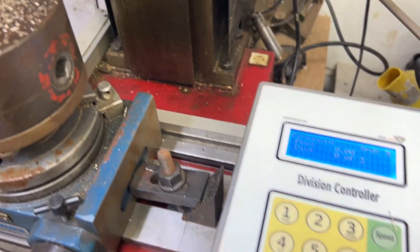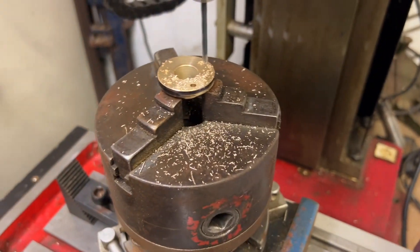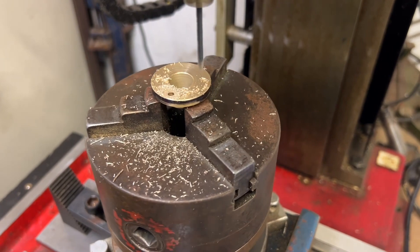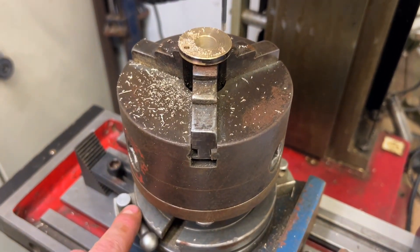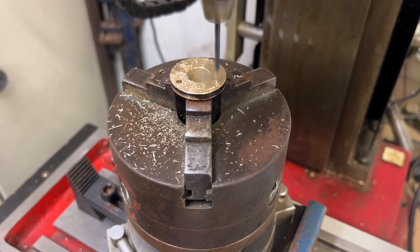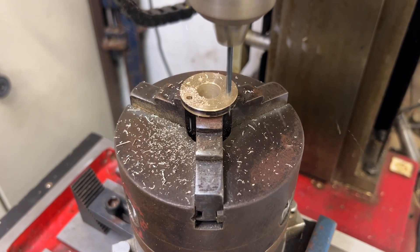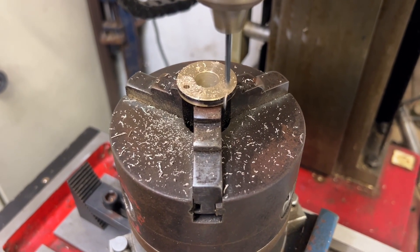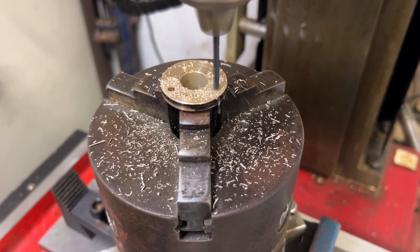So that's hole one done. We'll come back over here. Press forward. Now, I do lock that down, but I always find the stepper motor holds it tight enough for certainly a little drilling operation like that. I should really be using a centre drill, but actually I've not taken these to a full width. These are actually going to be wider. This is just to get a mark on the frames.